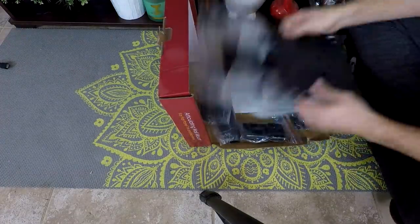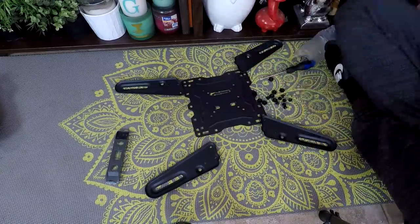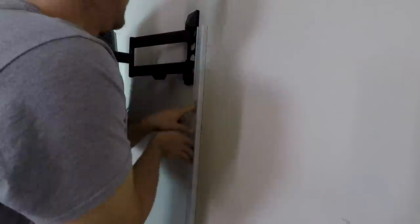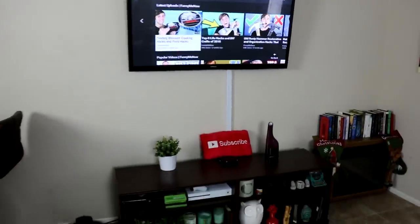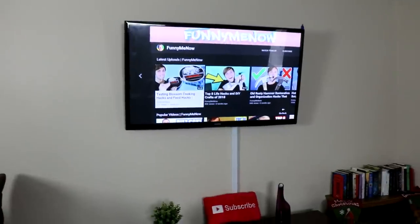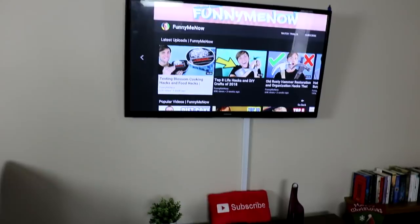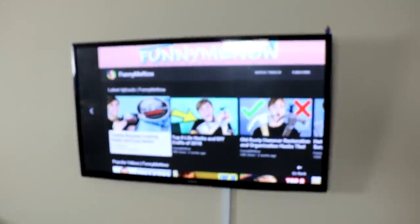If you've never hung a TV on the wall it's actually pretty easy — most of these kits are all the same. The kit I bought came partially assembled but I had to loosen it and put together the part that attaches to the TV. Most TVs have holes in the back and this plate bolts to that so you can hang the TV on the wall. I found a stud behind the wall and screwed the arm right into that, then stuck a raceway on the wall to hide the cords. Here is the finished product and I'm really excited about how it turned out. It's a pretty small room but I can actually see the TV from much further away now, which is kind of awesome. If you're on the fence about hanging your TV on the wall, I would definitely say go for it — nobody that hangs a TV on the wall ever regrets it.